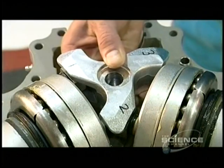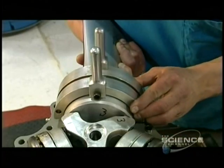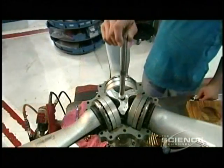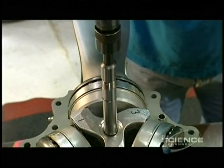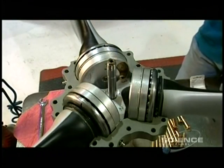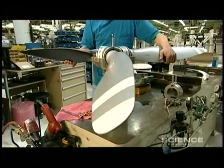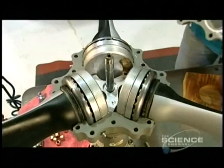The shanks of the three blades fit into a steel part called the fork, which keeps all the blades at the same angle. Next comes the pitch change rod — pitch referring to the angle of the blades. Engine oil exerts hydraulic pressure on a piston that moves the pitch rod, which advances the fork, rotating the blades to the required angle.